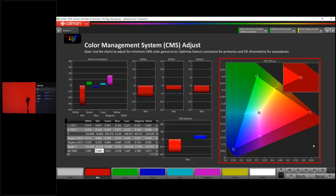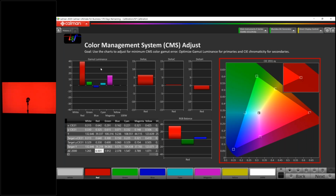Okay. It's still too dark. Let's turn it up like 3 clicks. Now this is going to really desaturate it. Let's put that back to 0. Okay, the saturation's better. It's still way too bright though. Man, it's like 1 click on the red brightness control is making such a huge difference. Let's also do this while I'm here and thinking about it. Let's put that contrast back to 43. Go down 1 click. Wow, 1 click. It's just slightly too dark now.